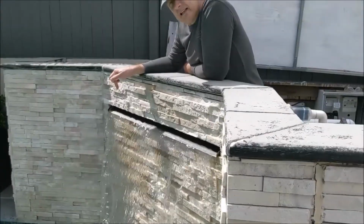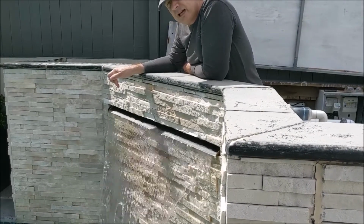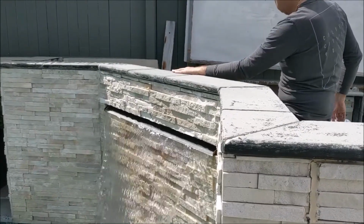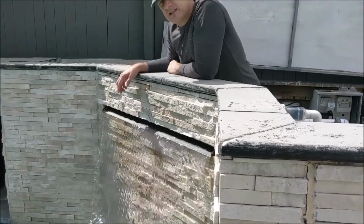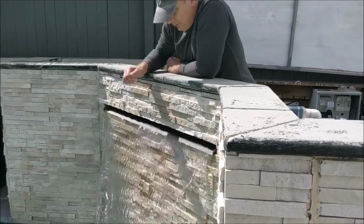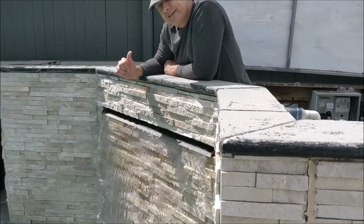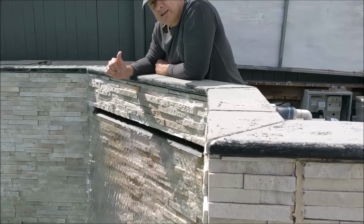This is preset 1, and this is 1900 RPM. The pressure on the filter is about half of what it was before. I'm still happy with that. I think I'll run it on the lowest preset setting, which is 1900. And that's going to be substantial power savings.